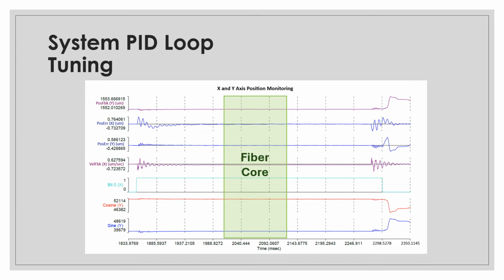And so we go back to this idea of this is why we wanted to have the grating plane length be as long as it is, so that as we pass through the fiber core, we've settled all that error in the y-axis out. We don't care so much about x-axis errors, but we do care a lot about the y-axis errors.